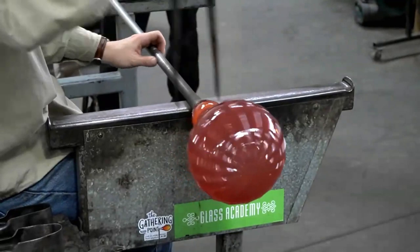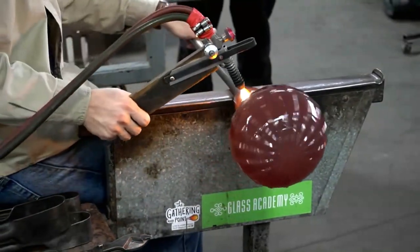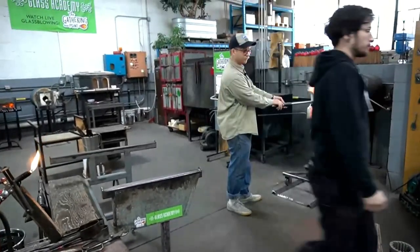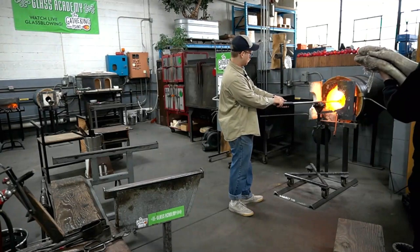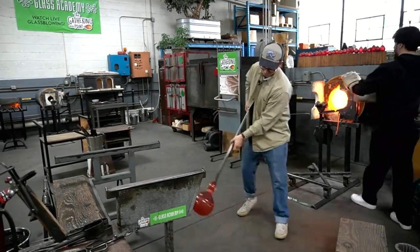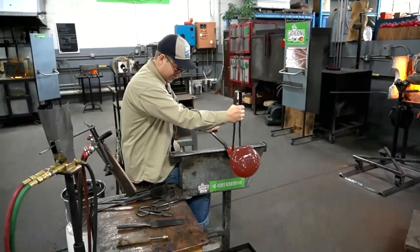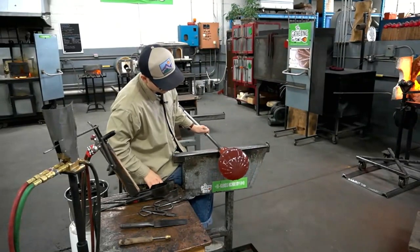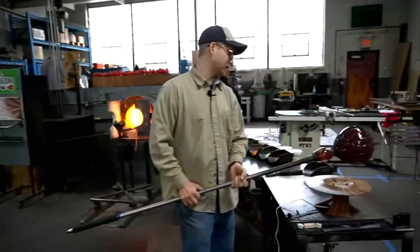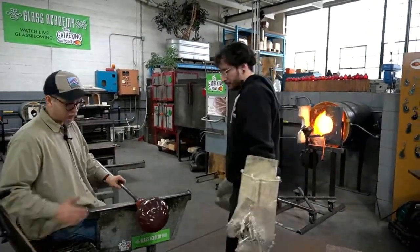I think a bulb is going to fit right in there just fine. I'm going to take one more heat, establish the neckline, and we'll knock it off. So you could probably glove up. It's got a little bit of extra torch heat — gave me that glowing spot right there, right on the neck. Perfect break point. I think we're looking pretty good. I think that's the right size. Let's knock her off. The nice thing is you can adjust that too, based on how much I cut it.